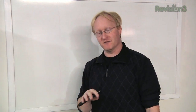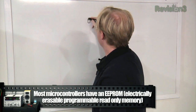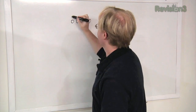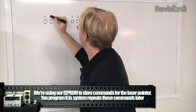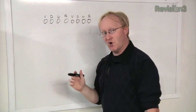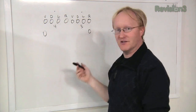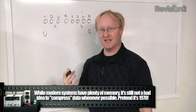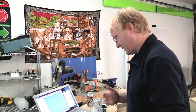The next step is making the device record your movement so it can repeat it later automatically. We can move it up, down, left, right with an Atari joystick. We have four bits representing up, down, left, right — and since one byte is eight bits, one byte can store two frames of movement. We store frame one in the upper nibble and frame two in the lower nibble, then frame three and four in the next byte, and so on. I'd set the sampling rate at 30 times per second. I've made a program that will now log your movements and store them to the EEPROM. We'll store something obvious like a square so we can verify we got the data right.